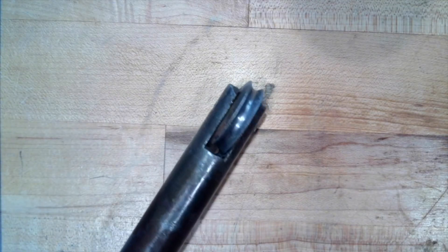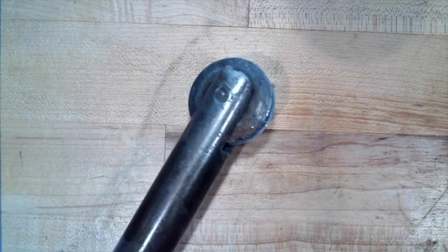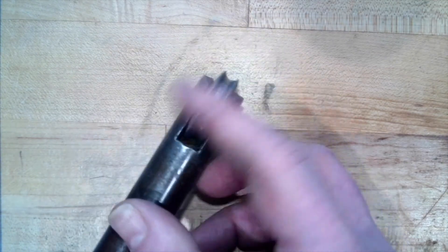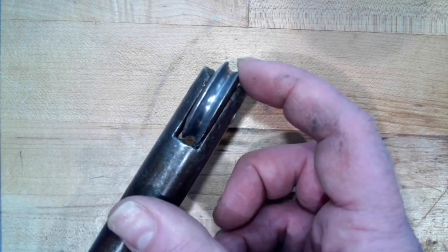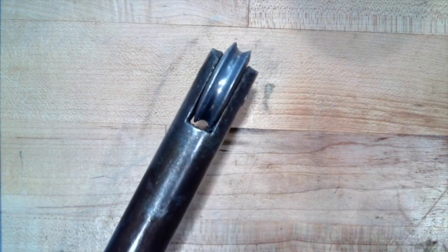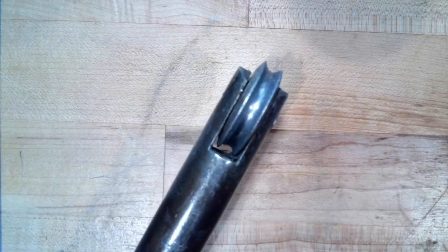Related to rolling an edge, some people like to roll a very tight bead on the end, and so a roller tool can be very useful for that. This is just a wheel that freely spins, with a groove in the end held in place with a rivet there. You can press that as the metal is curved over on itself to really tighten up that bead.